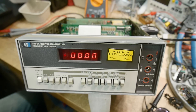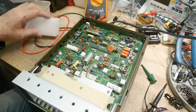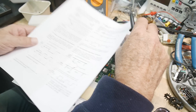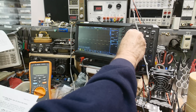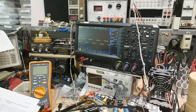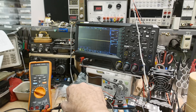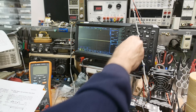It also gives you some waveforms to look at. We'll put ground on here. It says verify you have a 100 kilohertz clock at the CL test point, and we'll go there. That clock checks out fine at 100 kilohertz. Then it says go to test point PL, which is this one, and it says we should get a 400 millisecond period.